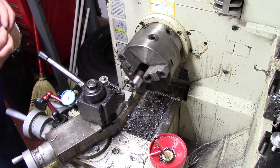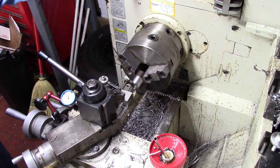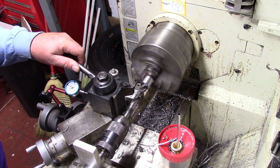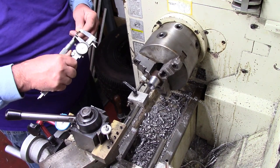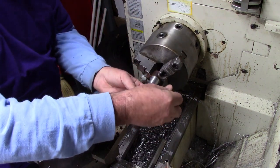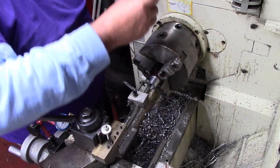This one here — we want this to be bored to slip inside of the other piece, so I need to get a hole in it. We're going to drill this for a 39/64 drill. We're at about 680-690, so we've got a good ways to go. I'm going to go ahead and show you a pass real quick.